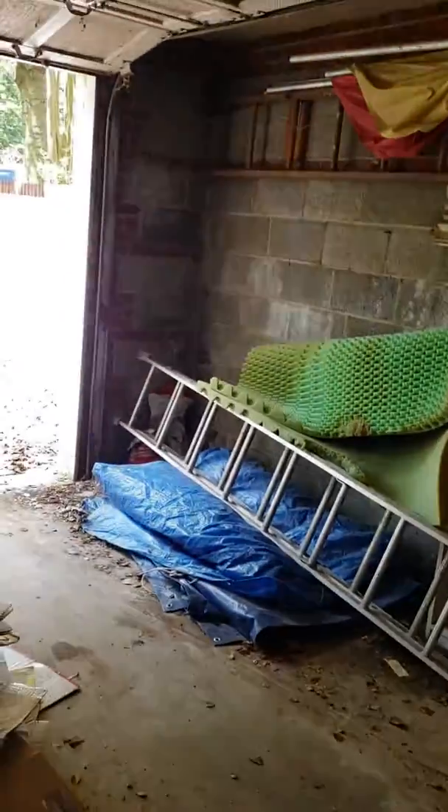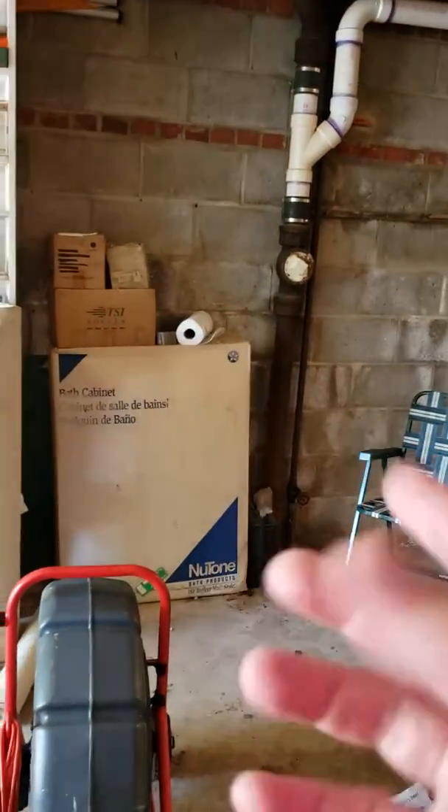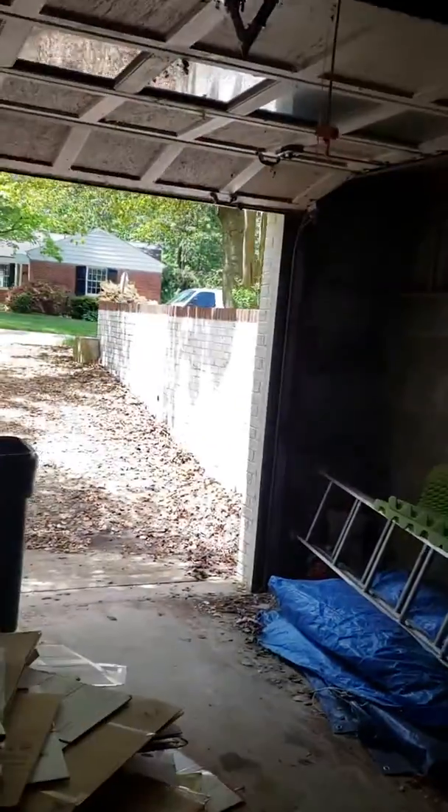The cast iron is going downhill — it's in good downhill grade shape, so that's good to go. New clean out, like I said, lower, new PVC pipe there, everything else is good to go. New liner, 20-year warranty.